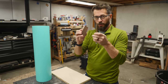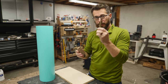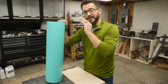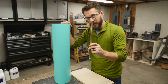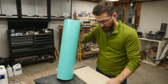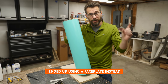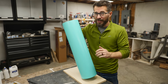I was planning on drilling the holes in this, but unfortunately this outside diameter is kind of in between sizes, so I ordered a different drill bit that should show up later today, so we're going to wait on these. In the meantime, we're going to start working on the form. I've got this piece of sewer pipe - it's six inches in diameter, which is about what we're going to want for the base of the lamp. I need to figure out a way to get my metal piece centered in this and make it so that it can be poured and then put on the lathe. To do that, we're going to cut out a plug that goes inside this pipe, and on the underside of that plug we're also going to make a little tenon that can fit into the chuck jaws on the lathe. Once we pour that epoxy, we can't go back.